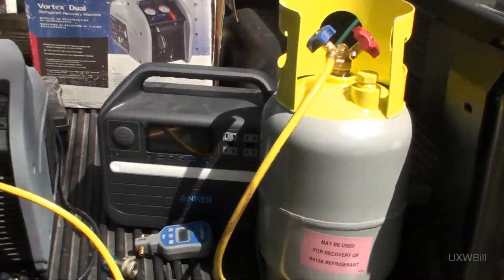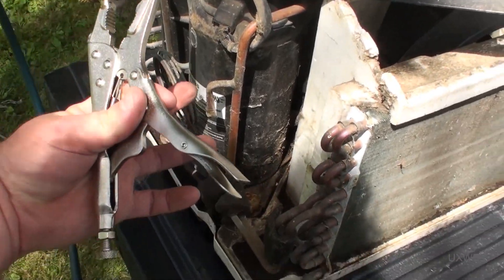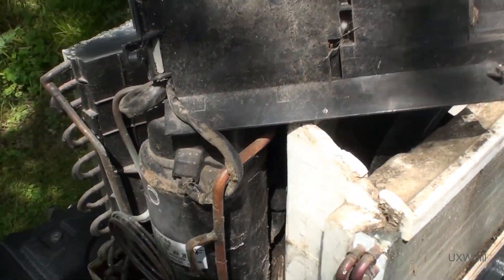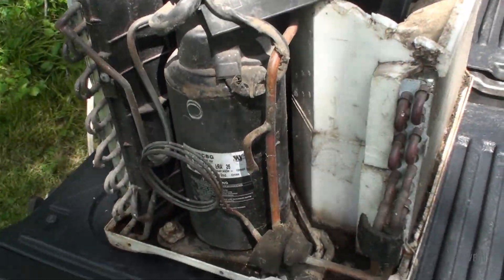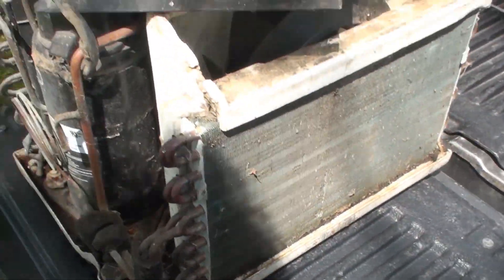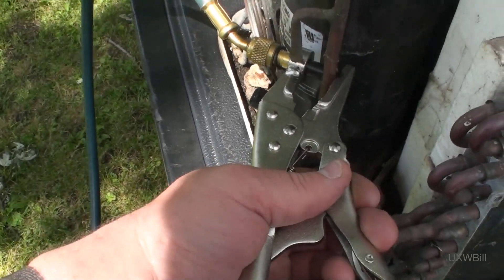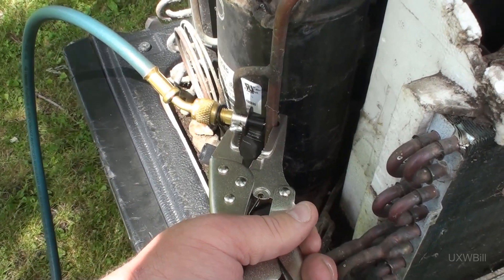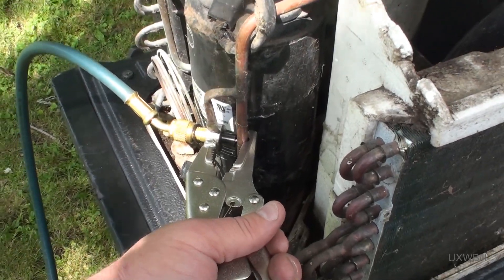So the first thing we're going to do — since I've got all the hoses hooked up — is clamp onto this low pressure suction line. You can see this little stub of tubing here. This is probably where the system was charged from the factory. I don't know if they charged it on the low side or high side, or maybe a little of both. Maybe this was just for factory testing to verify the unit was properly charged. I don't know what's going to happen here, but you only live once, so we're going to try this. Usually I would use a saddle valve, and I've had those go wrong before on a system that had leaked out most of its charge. Again, I've got no idea what's going to happen — probably something bad — but we're going to find out.